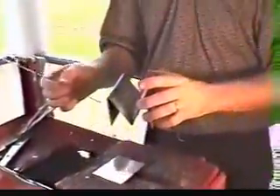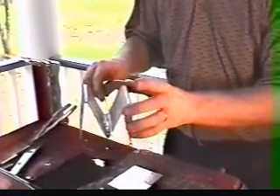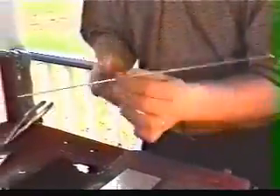That's just a standard TIG or Heli-Arc rod that you get at any welding supply. We use just a little flux — I've got a little bit of our aluminum welding flux mixed up as a paste right here. We sell those, and you can get them at some of the welding supply houses. We just mix it with some water, and that breaks that oxide layer on the aluminum down.